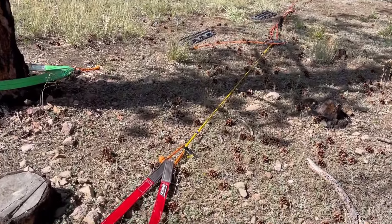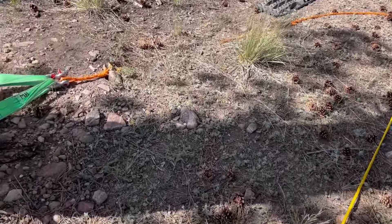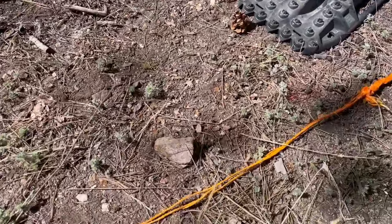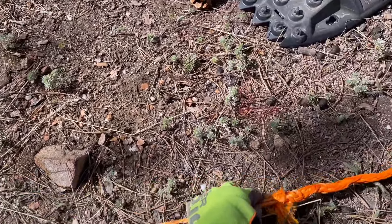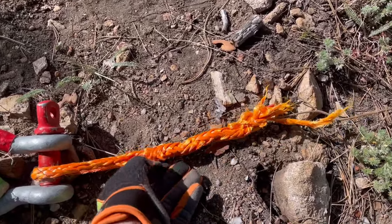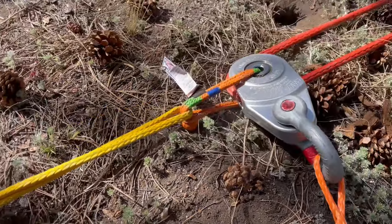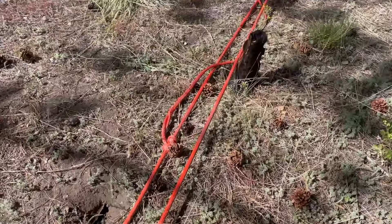Okay, so that actually worked perfectly. The safety lanyard arrested that gear — it only traveled a foot or two. You can see my line fractured exactly where I said it would. You have the telltale strings that pull through; usually it's only one, but this one's got looks like three that pull loose all the way. If you trace them you'll see it comes all the way up through here where it pulled out. But it's pretty dang cool. Worked exactly like it was supposed to.